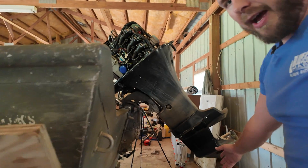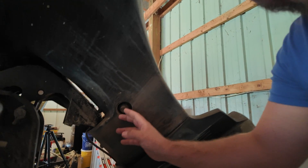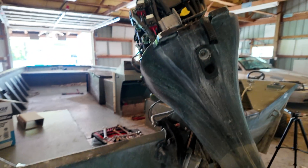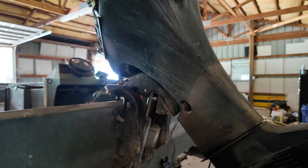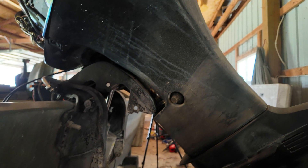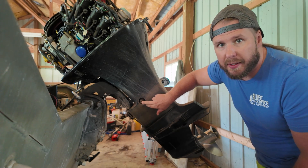Then the next thing we're going to do is trim this up to about a trailering position, just so that it's got a little bit of a tilt on it. That for context is right where I'm going to have it compared to the boat. Then you're going to want to tilt your motor to the side where your drain plug is. Spoiler alert — this is your oil drain plug. As you can see, I have turned the steering wheel so that the oil drain plug is facing somewhat down. The next step is to locate your drain plug, which mine's right here.